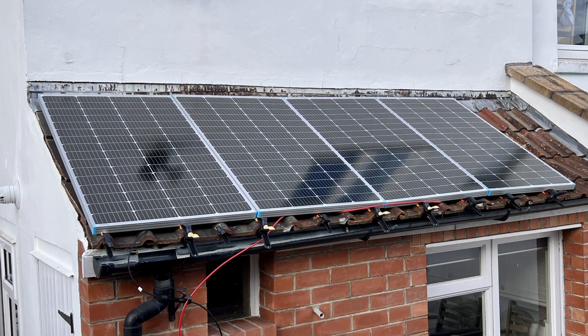I took my four Renogy panels — four 175-watt panels — and from experience over the last year they all perform pretty much identically. When the sun is in the right position you can get pretty much identical wattage across them. Two panels feed into one PV input and two into another, so I replaced the 12 AWG with 10 AWG on two of them to see if it made a difference.